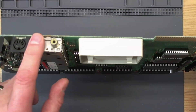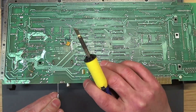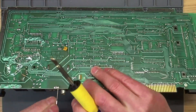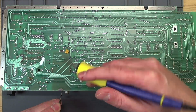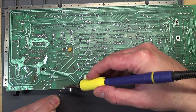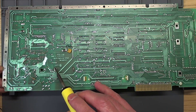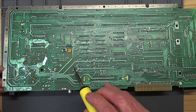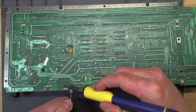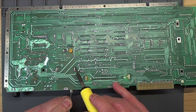What I normally do is put a very thin screwdriver in the back. I'm using a larger tip on the iron here — the idea is that this will just scythe through the solder a lot more easily without having to cook the board. This is a powerful T12 iron anyway, but this really does help even more. Going to heat these side ones — and that's starting to lift.